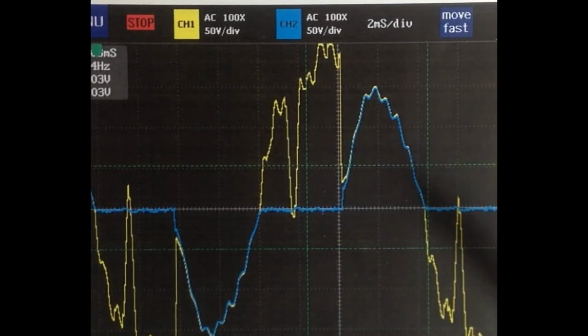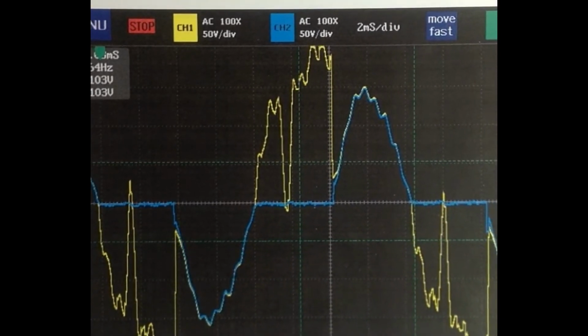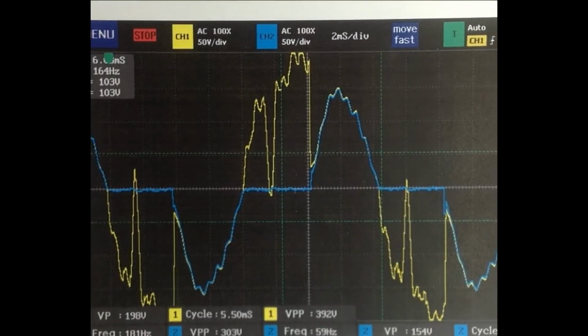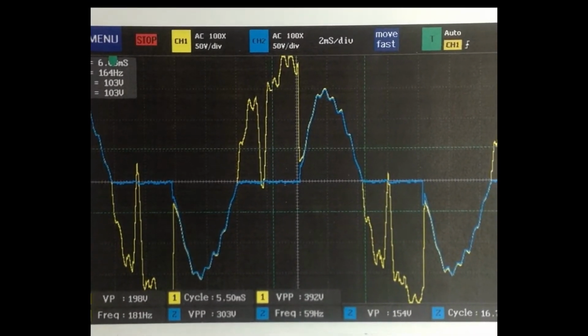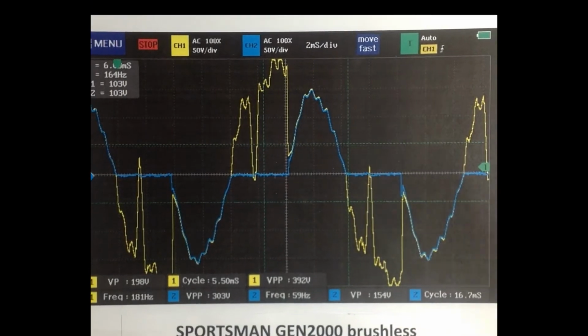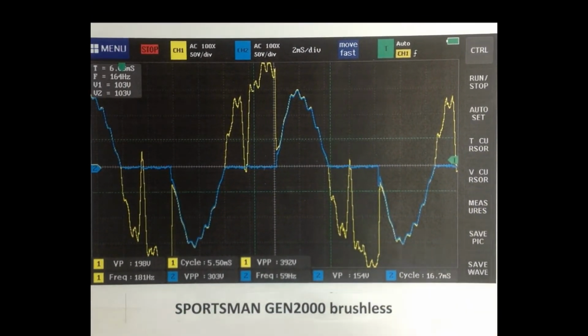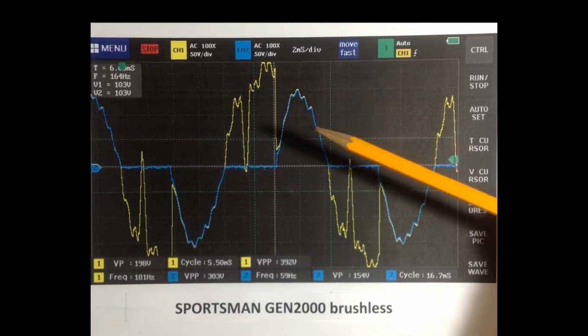then the dip here is really excessive. And I guess the thing to realize is that any relationship to a sinusoidal waveform here is purely an accident. I mean, this really got chopped up. It just really does not like the incandescent load that's being fed through a dimmer.